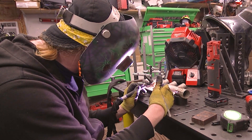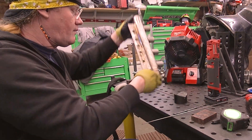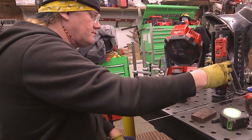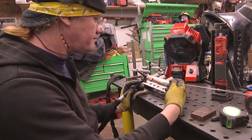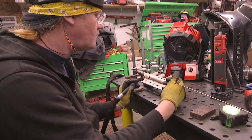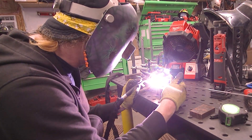I'm just moving around trying to minimize the heat input on any one piece of the part, and then welding the opposite side of where I was just welding. The TIG finger that Tips and Tricks sells is awesome for sliding around on a table like that — I'm just using it to slide my hand back and forth.